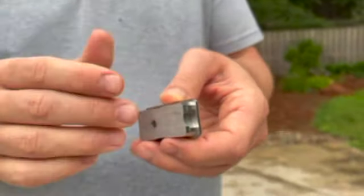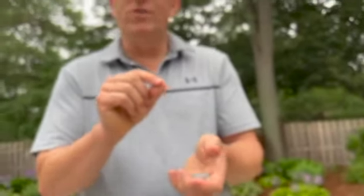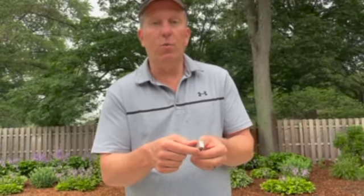Also, when stainless is rolled around, there is a point where the flat comes together and it is laser welded — it's called the seam. That seam is typically on one of these edges, and that's one of the other reasons why we have a nice relief cut, so that we don't interfere with the seam when we tap this on.